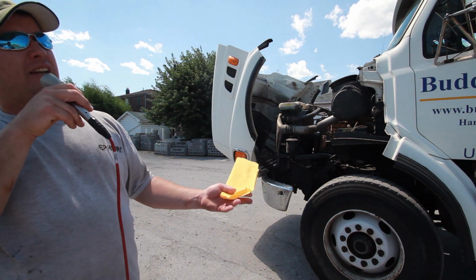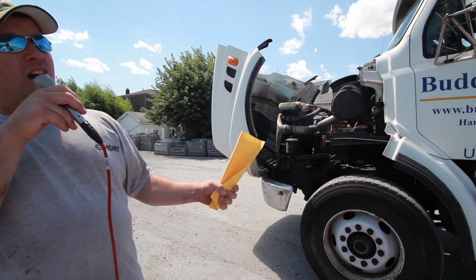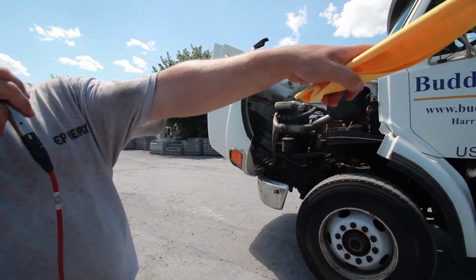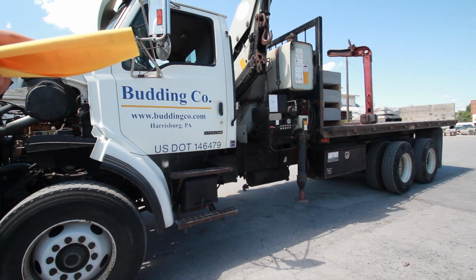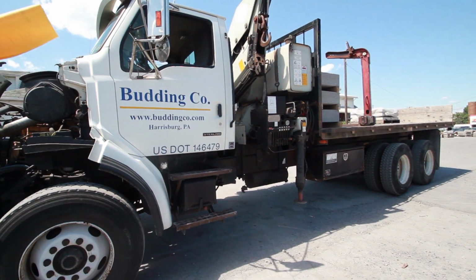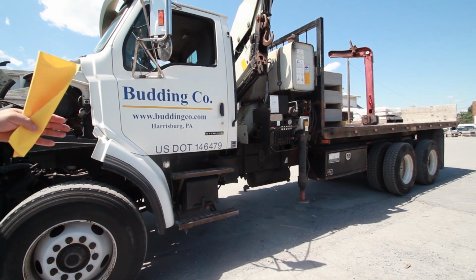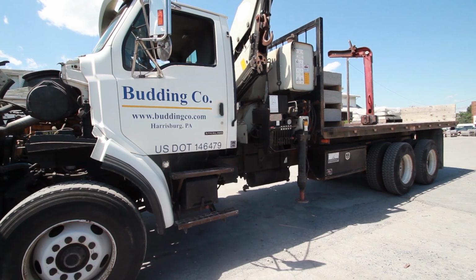When operating the crane, one of the biggest things that you should not do is, if you look back on the bed of the truck right now, you'll see a skid that's sitting on the passenger side. When you stick your forks into that, you do not want to lift that off the bed at that point over there. You want to drag it back over to the driver's side so it's within your eye line sight good while you're standing at the controls. Then lift. Because if you lift the other way, once again, there goes a car driving by.